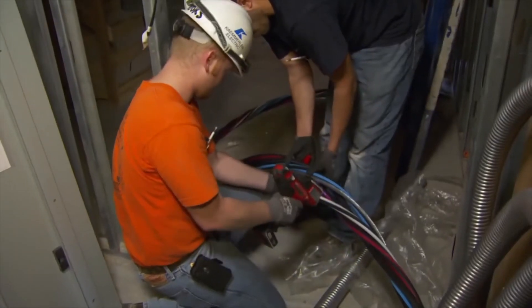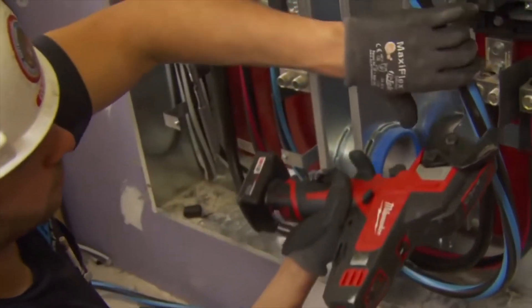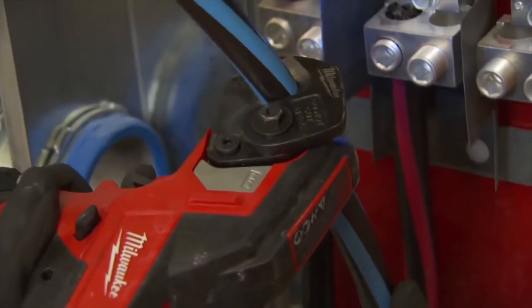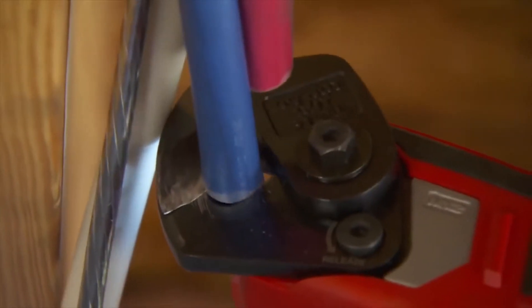Sometimes when you're in tight situations like what we've been working with, there's no more room for extra cutting — you get one chance. We would use it every time we're terminating cables on a bigger wire. It's got multiple speeds. If you're cutting the bigger wire, go with the lower speed. If you're cutting small wire, don't waste time — bump it up and have at it.